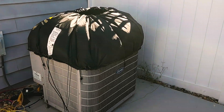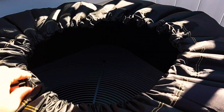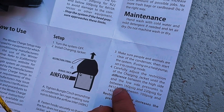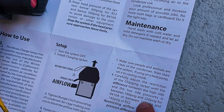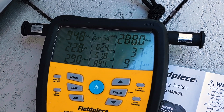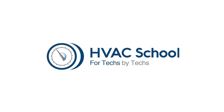Always start with the top open — start with it wider and then tighten to restrict, to increase it. Here's where we get down to the nitty-gritty: you carefully adjust the restriction of the charging jacket until the difference between the high side and the low side pressures is between 160 psig and 220 psig.